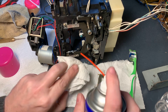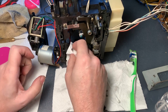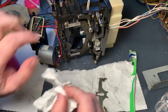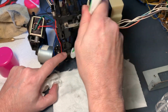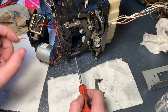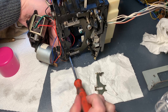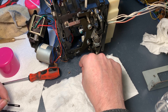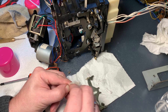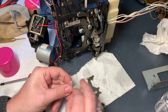What's really important is that we take care of these flat steel springs. On some of these springs there is a little iron ball — it works a bit like a ball bearing — and the whole bridge mechanism moves up onto these balls. I first thought maybe just a cleaning with some WD-40 and a toothbrush would be enough, but then I changed my mind and decided to disassemble them. Be careful that you don't lose these little tiny balls. I cleaned both of them really well, removed any old grease, made them shiny again, then put on some new lithium grease and reinstalled them back into the deck.